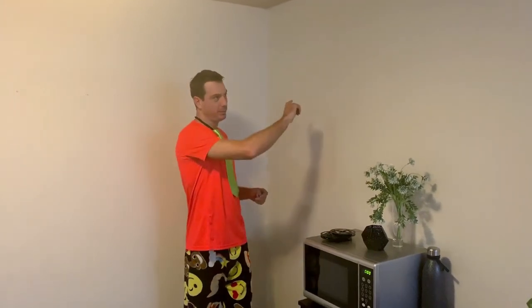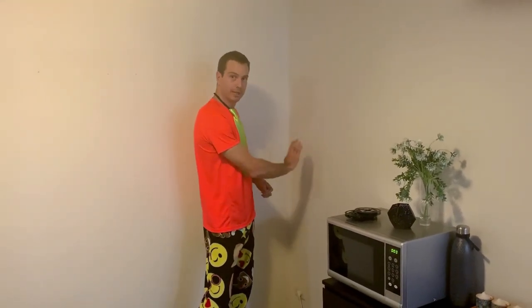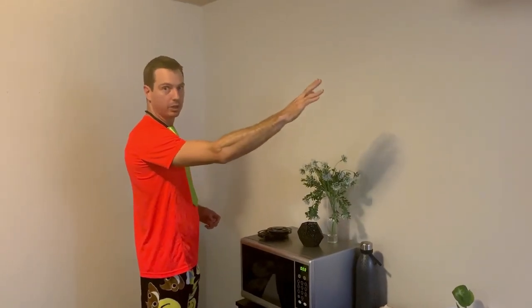Now we're in the other corner of the room. We're going to be placing one light along this wall and one light along here. The first job is to choose a central location and we're going to be sticking the plastic hook to the wall — this is to support the weight of the power adapter and the cables. The hooks come with a 3M strip and when using any 3M product, they recommend that you clean the wall surface first with an isopropyl rubbing alcohol. So be sure to clean down the area where the hook's going to be going, and also clean down the area where the strips will be going along the wall.